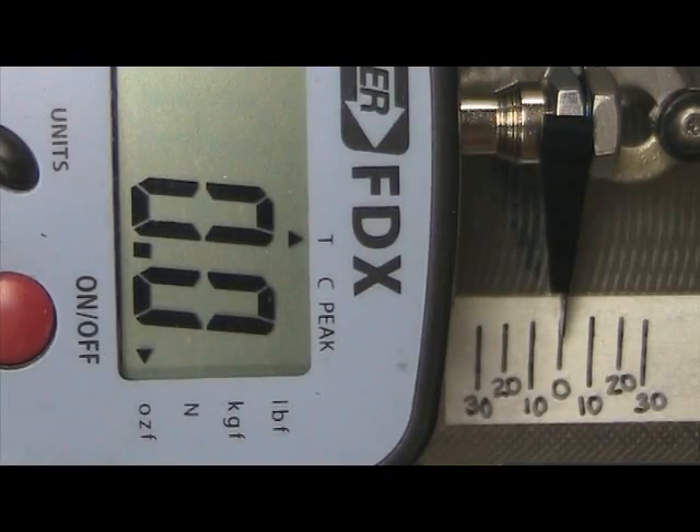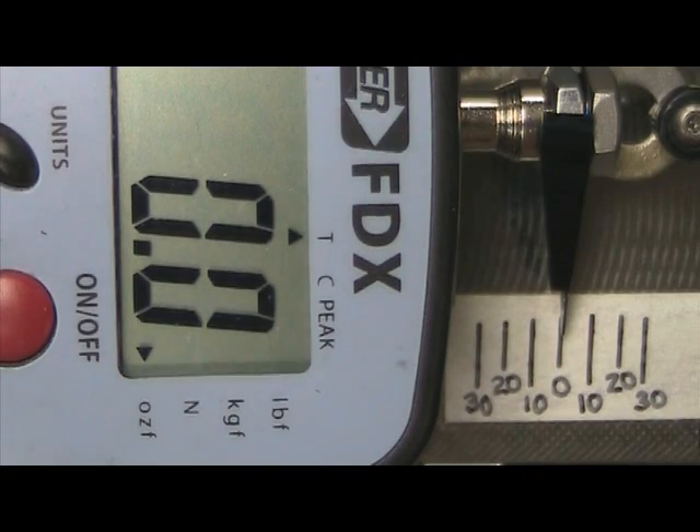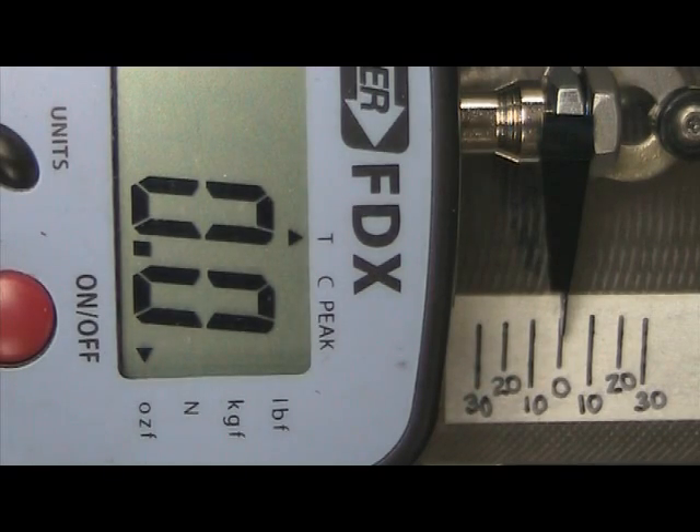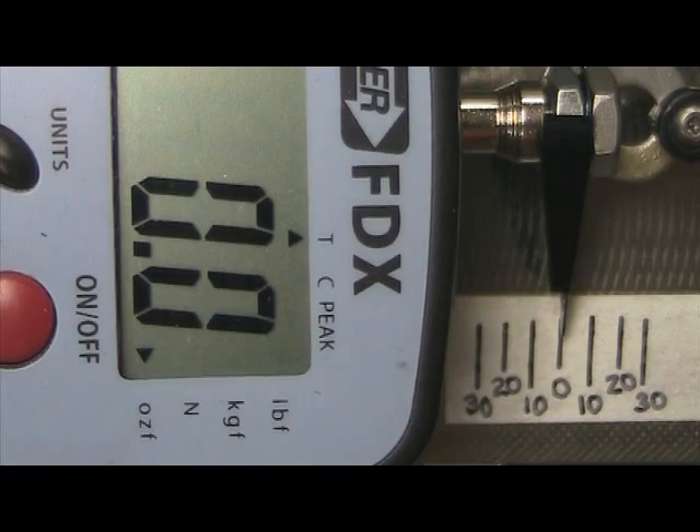Play550 with KB Dream Design 84.5mm blades running at 9400 RPM, which equates to 2000 RPM head speed. We are using the stock blade nut and bolt. So this is our baseline pushrod force that we are starting from.